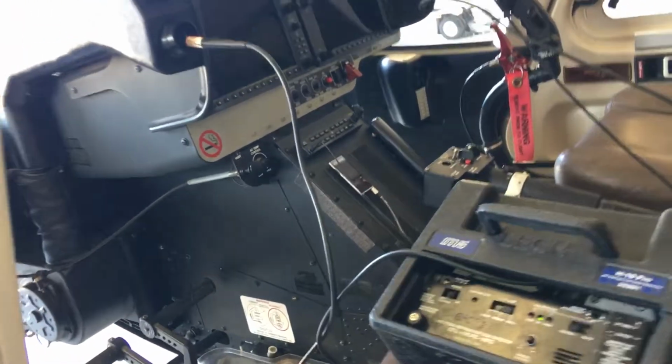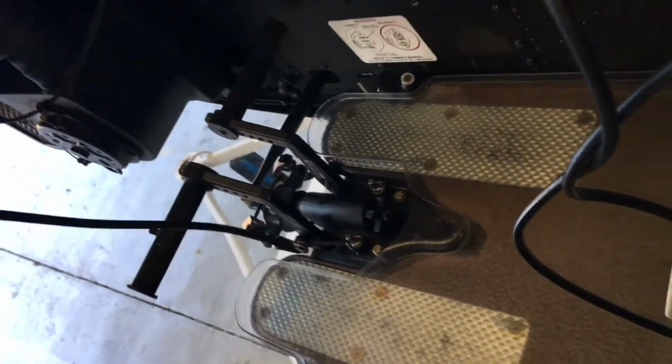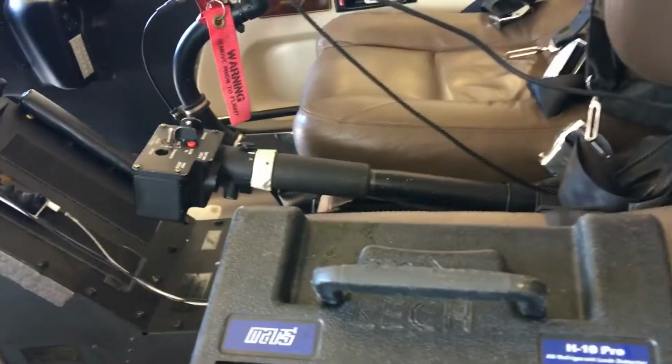Now sometimes one of the secrets to helicopters: refrigerant's heavy and it goes down low and it goes below the deck and it'll form underneath. So you actually want to take a measurement from down here, the lowest spot, and get down underneath in the lowest panels, in the belly. Because lines go underneath, up over, but refrigerant is usually heavy sometimes.